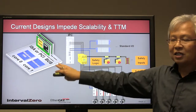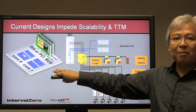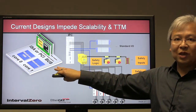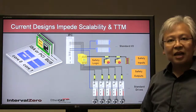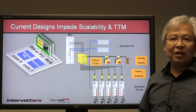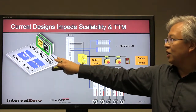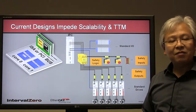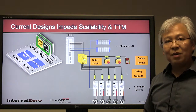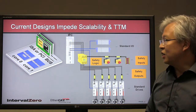When you have multiple architectures inside the system, you can't progress as fast as you'd like because you're only as good as your weakest link. Although multi-core x86 motherboards tend to double performance roughly every 18 months, these proprietary boards often do not. You're tied to specific roadmaps for those processors, or to the fact that the boards are custom-made, requiring a whole new plug-in card design for your next-generation device.